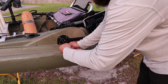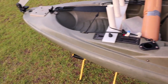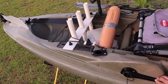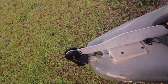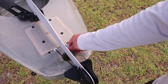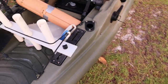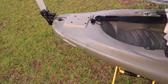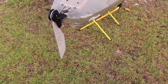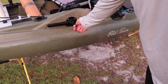Trying to go back down but I didn't tighten it. Forward's good, backwards not — we'll pull that tight, and now we'll tighten the other one that we just loosened to do the ops check. All the way down, which is going to pull the slack out of that one too. Now you'll be able to see going down, going down, coming up, coming up — and obviously if we were steering she'd land right there. Nothing to it.